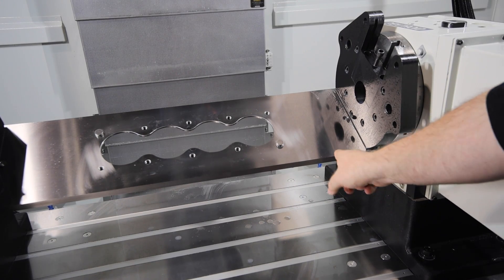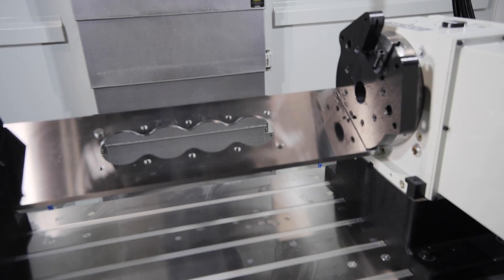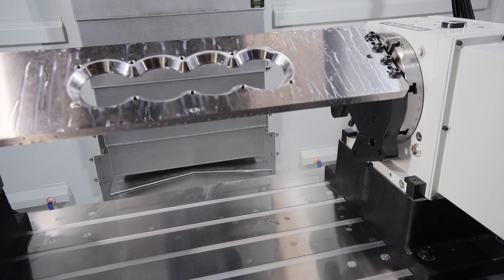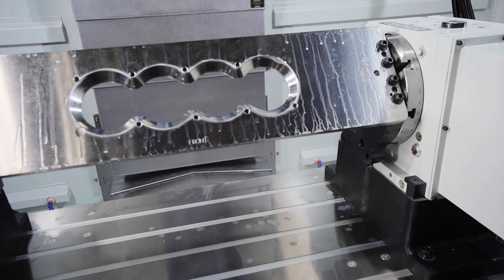Here's a quick look at the plate. You're going to use two dowel pins just like an OEM cylinder head. The cylinder head gets bolted into the machine, and this is where the combustion chamber would go. Now, it's good to mention that some of you hit us up about obscure heads, and the issue is that you have to make a precision ground plate to put it in the machine. It's not just easy — you actually have to make a plate, and it's expensive.